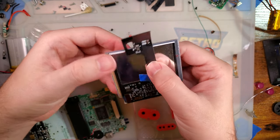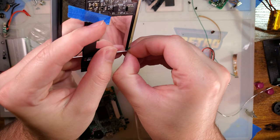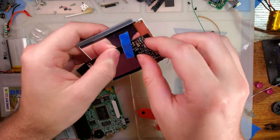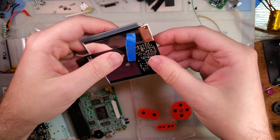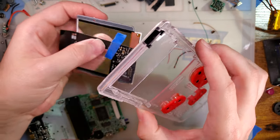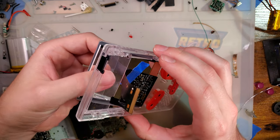And I don't recall if I mentioned this before, but this mod, the Giltessa one that is, not this backlight kit, it doesn't care what backlight kit you use, it just cares that you don't use an OEM screen. Part of this board's job is to generate voltages that the OEM screen needs, and so if you have it removed, it can no longer generate those voltages.